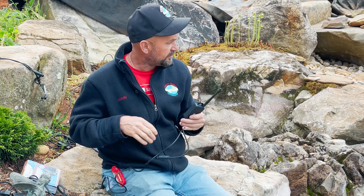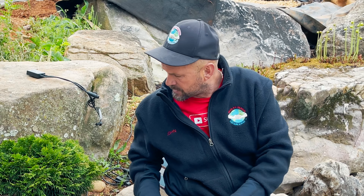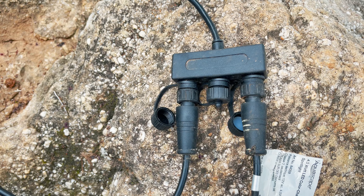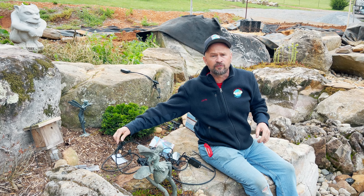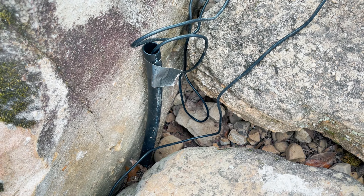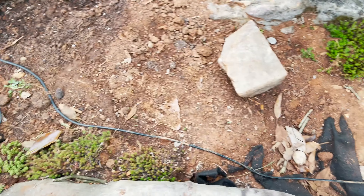It's that simple — run it close to home, get it where the antenna picks up the signal. I run power from my transformer over to that side. I've got one control hub on the other end of the log controlling my fountainscape, and this control hub on this side runs up this side. I've used the 25-foot cord that has a connector for lights every five feet, and in a few places where I have two lights, I've used a three-way connector to put two lights into one connector. Then I was forced to run a conduit underneath where our stream is going to be. I put a 25-foot lead through there, plus a 25-foot extension cord for color changing lights through the conduit, feeding the lights that go down the waterfall on the other side. That's how I've split my two zones up.